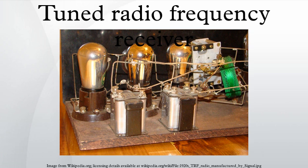This particular example uses six triodes. It has two radio frequency amplifier stages, one grid leak detector amplifier, and three class A or A1 audio amplifier stages. There are three tuned circuits T1-C1, T2-C2, and T3-C3. The second and third tuning capacitors, C2 and C3, are ganged together and controlled by a single knob to simplify tuning.